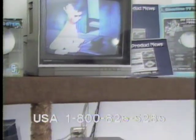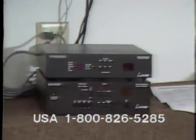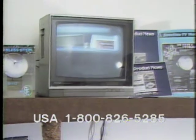If I want to, say, go to SATCOM 3 now, I punch in satellite, SATCOM 3. The green active light comes on again. I am moving. Now we have arrived on SATCOM 3. I'm on an odd channel. The polarity is automatically corrected for. If I go to an even channel, it automatically brings in with the polarity correct. I can punch up any channel, and it automatically handles the polarity adjustment.